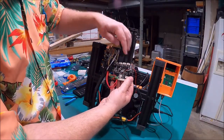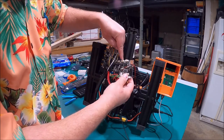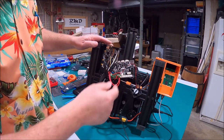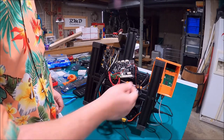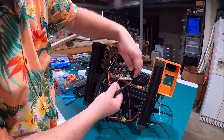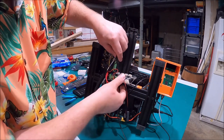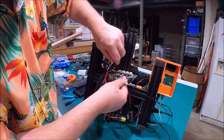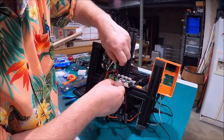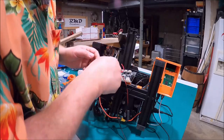Now that I've replaced all the plug-in wires one by one — and as I may have said before, there's a drop of hot glue on each one of these you're going to have to peel off before you unplug and plug those in. You don't need to reapply hot glue after that's all said and done. I've still got my cooling fan tied on here; I haven't done anything with that yet. So one by one I'm going to work from this end down so you don't get anything confused. I did take a picture of this before I started, which is what you should do.